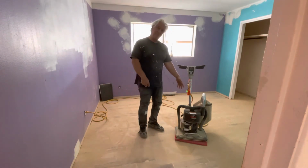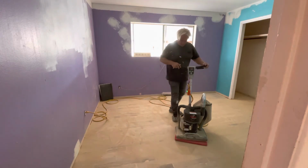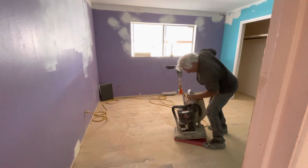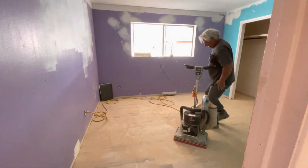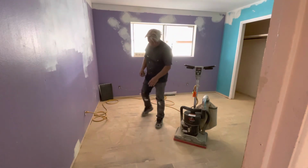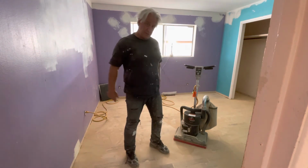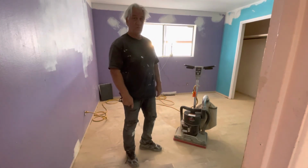That's when you work up with the finer pads and you can see that this is a joke. And I already told the guy at Home Depot, and he's gonna work with me. He's gonna give me some better or some free pads, okay? I'm gonna show you what it looked like in the end. Watch my other videos. So all it is, I got 20 or 36 on there, I can't remember. I'll take it up to 220. This thing will be smooth, it'll look nice. And these floors will outlast my house.